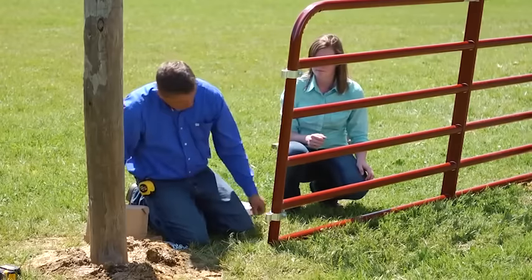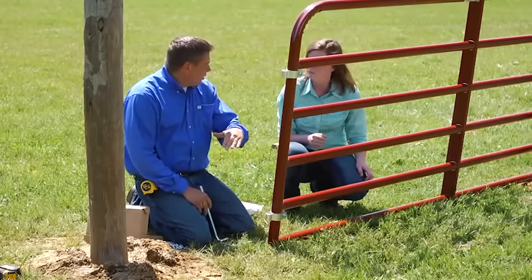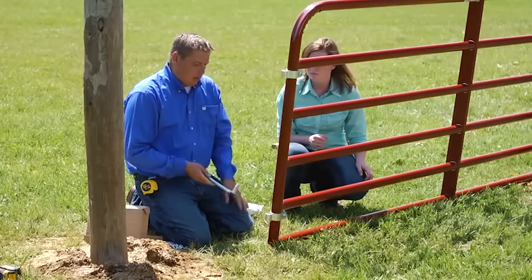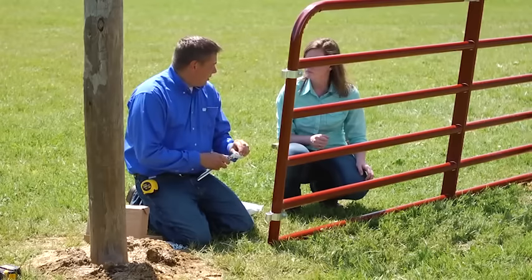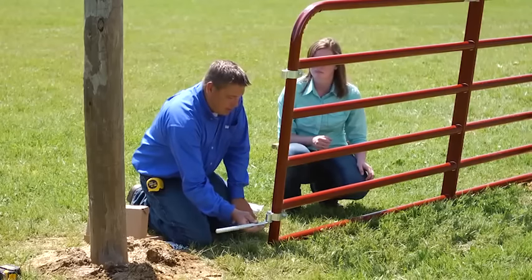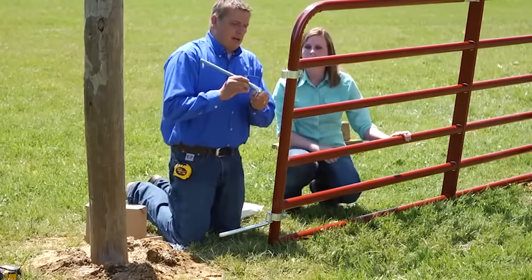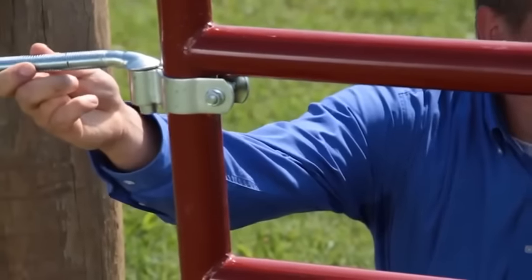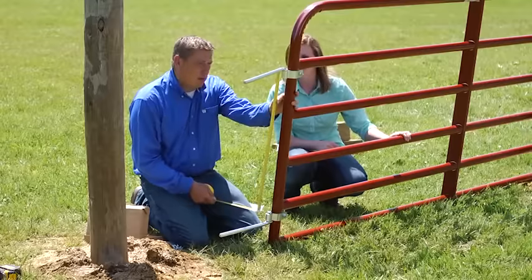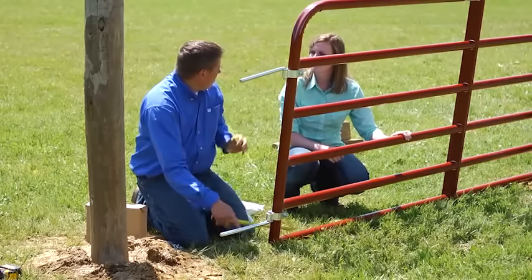Once you have your hinges mounted, we're going to install our bolt hooks to get measurements and find out what our spacing is. Your bottom bolt hook has a tab on it — they both have a tab. You're going to need to install it at a 90 degree angle and then turn it 90 degrees back straight. That gives you a support that keeps it in there and helps keep the gate from coming off the hinge. Your top one, for ultimate security, you're going to turn it upside down — put it in at 90 degrees off and rotate it around. Then take your tape measure and measure between the two pins center to center. We're at 31 inches center to center, with your top one upside down and your bottom one installed as shown.